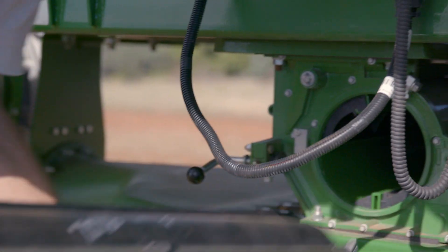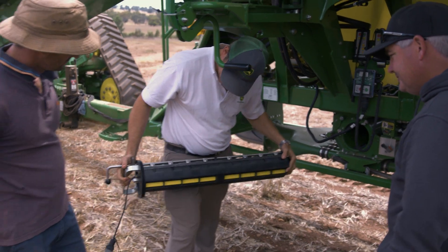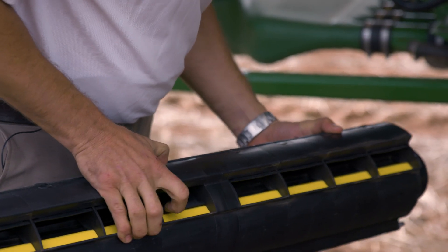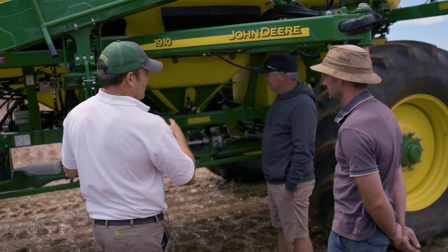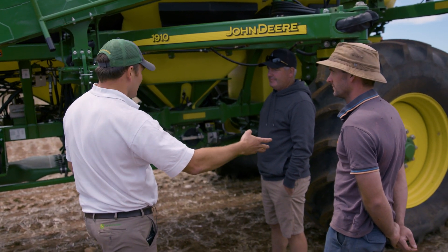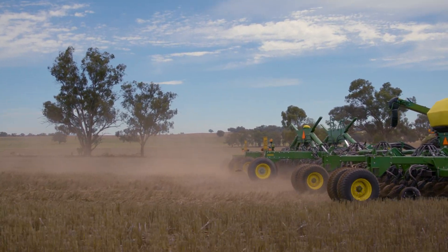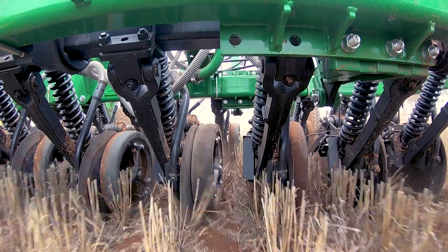You've got your meter cartridge, pretty similar to what we've had before, except you'll notice those buttons on the back. Those buttons are where your actuators come through and push — they actually push these flaps, and those are all independently controlled. So for this bar we're doing seed and fertilizer together, but if we had a bar with a different gang of fertilizer we could control those sections based on where they are placed on the bar.